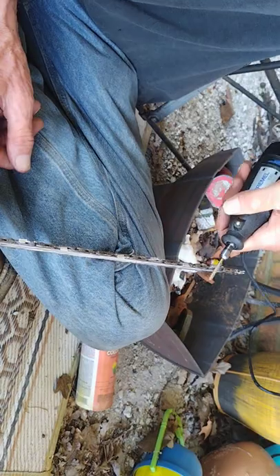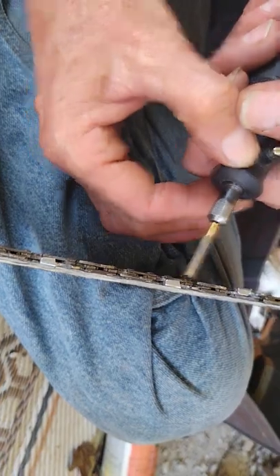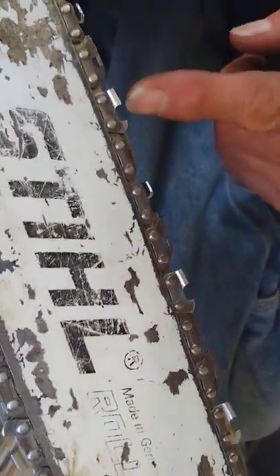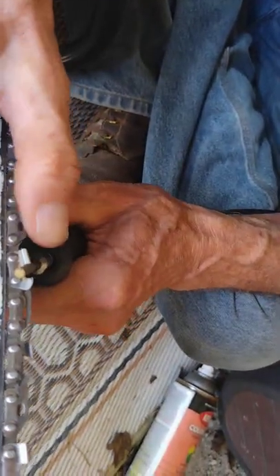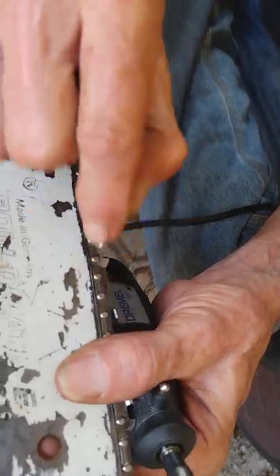Back to what I was saying — there's three things you're sharpening: this edge right here on the top from here to here; this edge from here to here, the point which grabs the wood down here when you're getting a hold of it; and then that side tooth over here. See how it's kind of a moon shape? That's where it's mostly dull — that side tooth. It's supposed to be a crescent moon shape when it's right. The point will come on down in there and you can see how it's not just right there, but it'll be like a crescent moon shape.